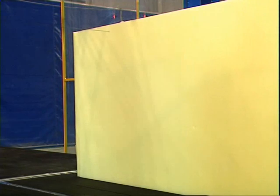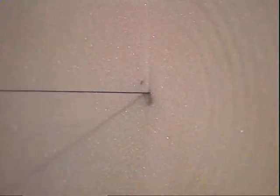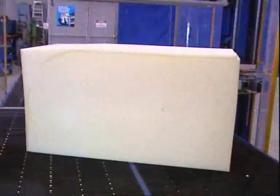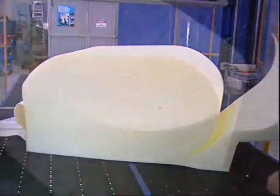When the peeling is finished, the challenge of removing the blade from the center of the block without cutting sheets or breaking blades is only possible on an oscillating blade machine. On the Wintech oscillating blade contour cutter, it is as simple as changing a blade. Simply release the blade at one end and then slide it out of the block. The block is then ready to unroll for use, or kept together as a whole for transport and storage.